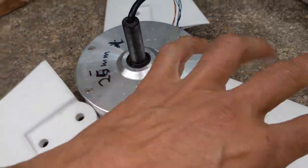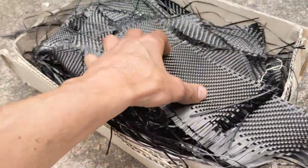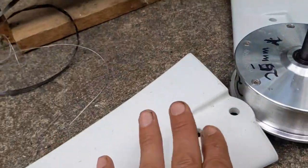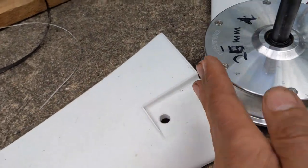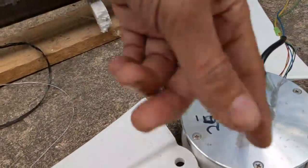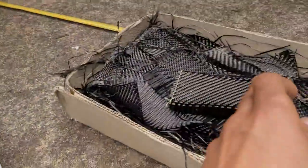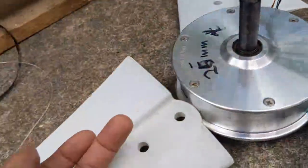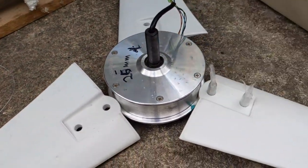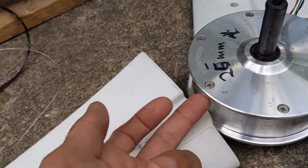To get equal weight on all parts, if you use sheets you'll need a method to coat them with epoxy equally and cut them to the same size. My idea is: first position one sheet going upwards about two centimeters, then with carbon fiber roving do some wrapping around so it bends to a right angle, then add another sheet, another roving cycle, another sheet — really five to ten layers so it's going to be very strong.